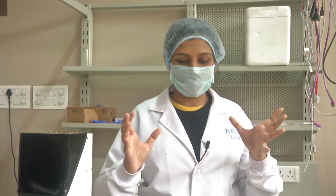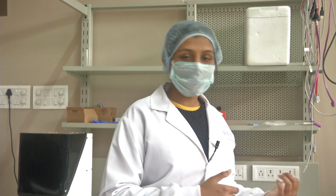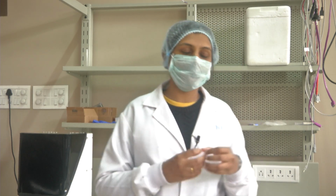I hope you've got it. This was just a brief introduction as to how there are different properties of these alloys. You can go ahead and look at the different variants, the different combinations of alloys which are available. Make sure you understand the working temperature, because the nitinol wire we've used here does not get heated much. It's just a few 200 milliamps with what we've shown for the actuation mechanism. So the heating is not really high. When it comes to stents, they can operate at 37 degrees Celsius, but there are alloys which require 100-200 degrees Celsius.